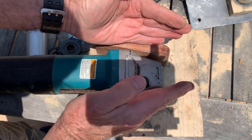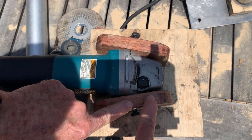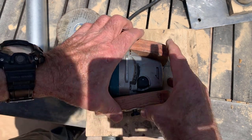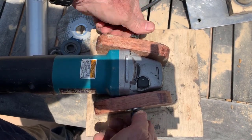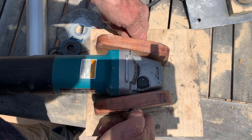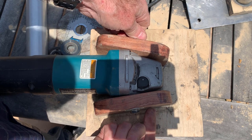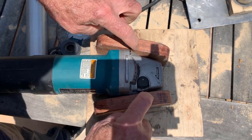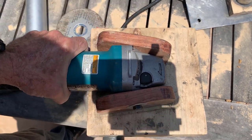You notice that this is on an angle. What I actually did was I made these pieces and drilled the holes in them, then glued it down in place with the bolts engaging those plates. Then I drilled holes up through here so that I could put wood screws to hold this. Just good construction practice.